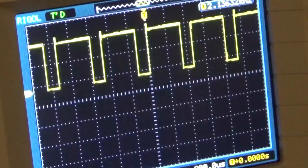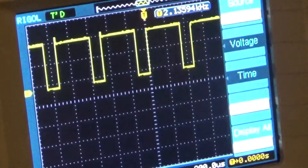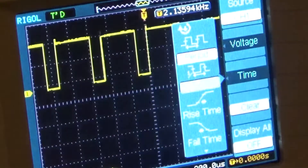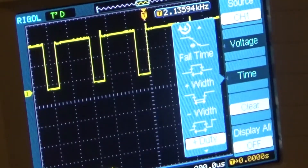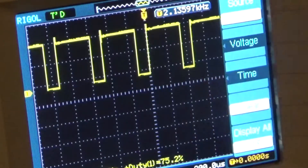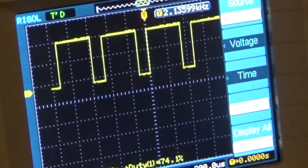The 555 is about two kilohertz at a 75 percent duty cycle. I'm on output pin 3 of the 555 timer. I'm going to take some measurements here - I want to see the frequency and I want to see the duty cycle. As you can see, just like the book says: 75 percent duty cycle and a frequency of about two kilohertz. That's on the 555.